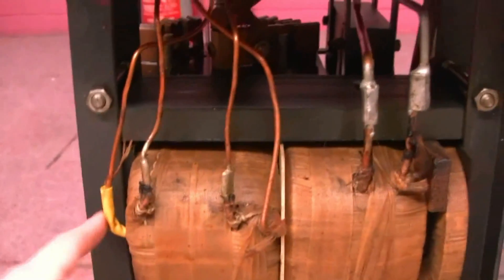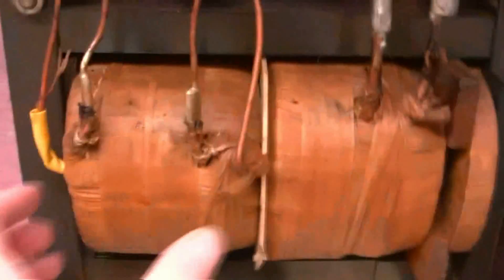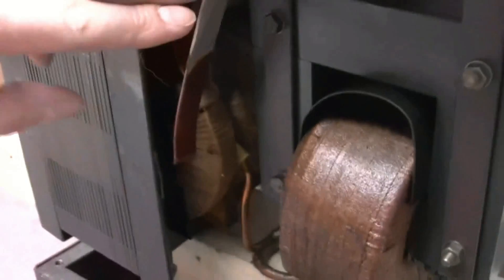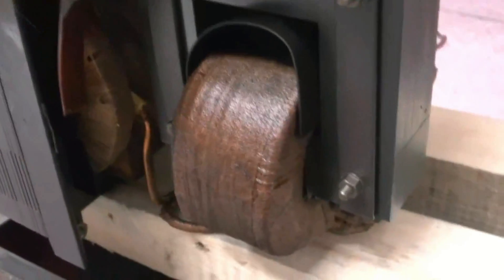These are really easy — there should be no problems with this at all. This is our primary, so we've got 0, 200, 220, and 240 volts — quite straightforward. I only need two of those taps for the primary. This is the interesting bit, the secondary — it may be a little confusing but it's quite straightforward. This is a 50-volt winding, there's an 80-volt winding, and around the back there's a big fat common. Around the other side there's a set of windings which develops 250 amps — that's fine for a bit of spot welding.